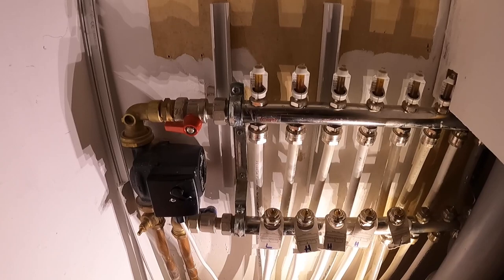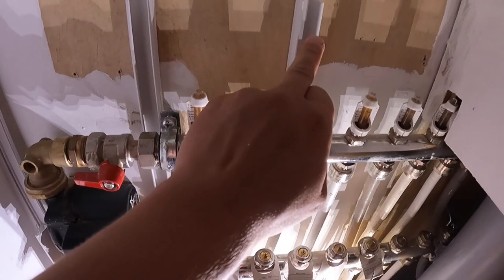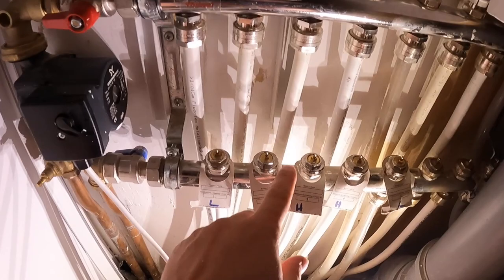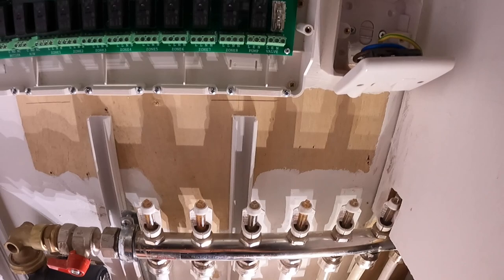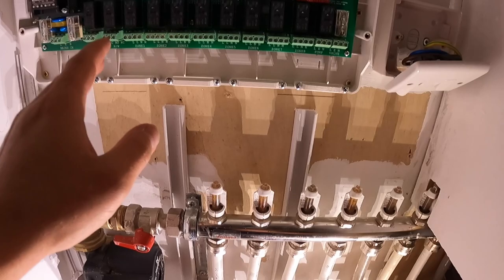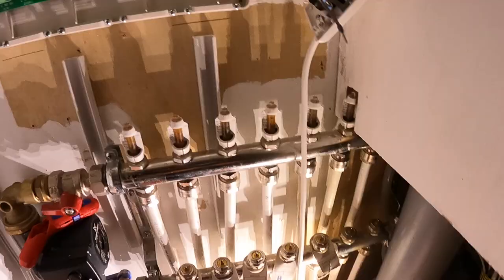The client has given us a lovely big fan — it's hot in this cupboard because there are server racks behind me too. I've got two bits of trunking in here. The new cable on the pump will run up, and I'll bring probably four heads through one way and four the other. Some zones we're going to double up because we only have four thermostats, not eight — so two heads will open simultaneously when one thermostat calls for heat.